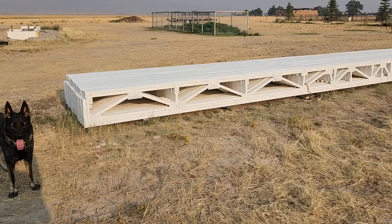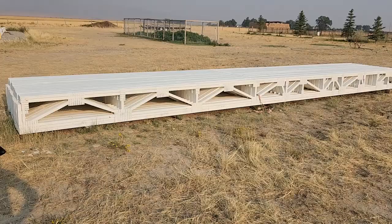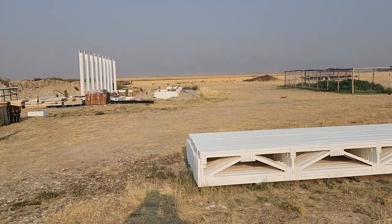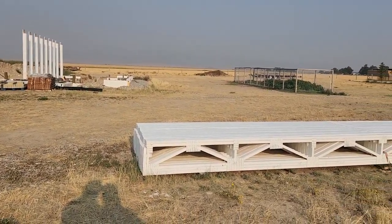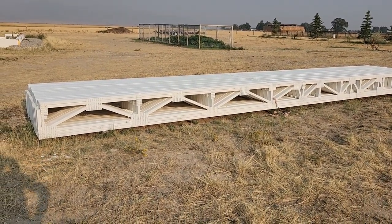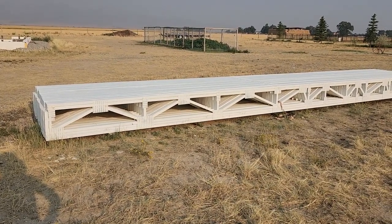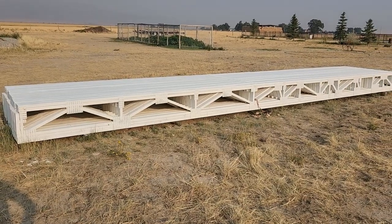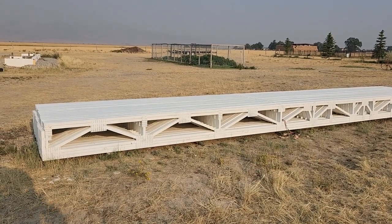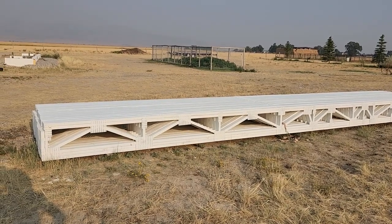Here are our trusses — web trusses, which are actually floor trusses, and we're doing that intentionally. We're going to put a single-slope roof over the top of the Wallapini on these columns. The trusses are 28 and a half feet long and about 18 to 19 inches in width, so they'll definitely carry that load. We're putting polycarbonate on top, and everything is painted white. Kim did all the painting to maximize light reflection in the Wallapini grow area.